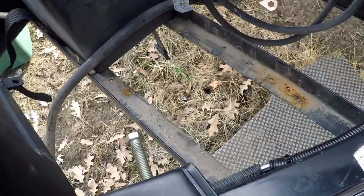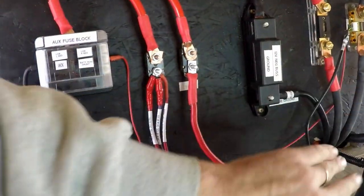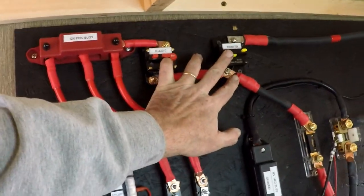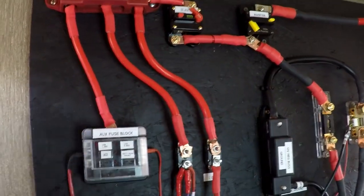Time to start getting the battery back in place. I'm going to go ahead and get the box back in place, get it screwed back down, get the battery on. We are at that point where it's time to hook the battery up. Since I've got the catastrophic main fuse coming over and hitting these two breakers, I'm going to go ahead and trip both of these, and the only thing that will be alive is from there back to the battery.